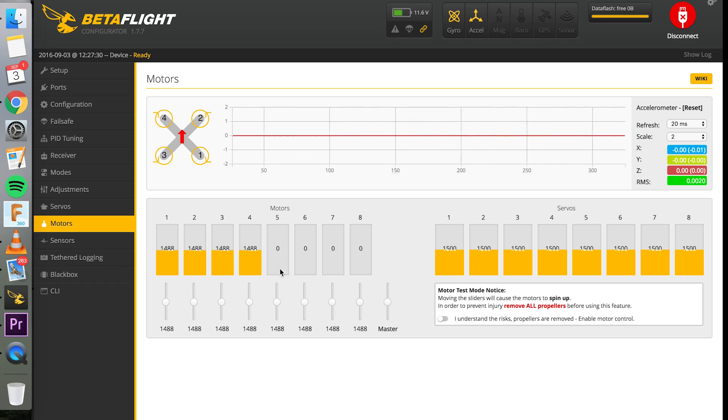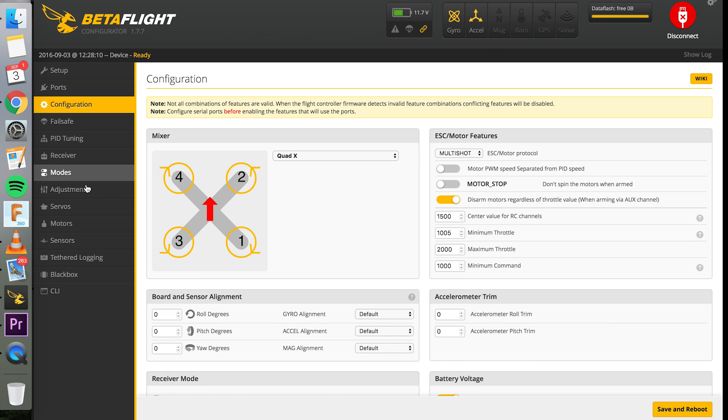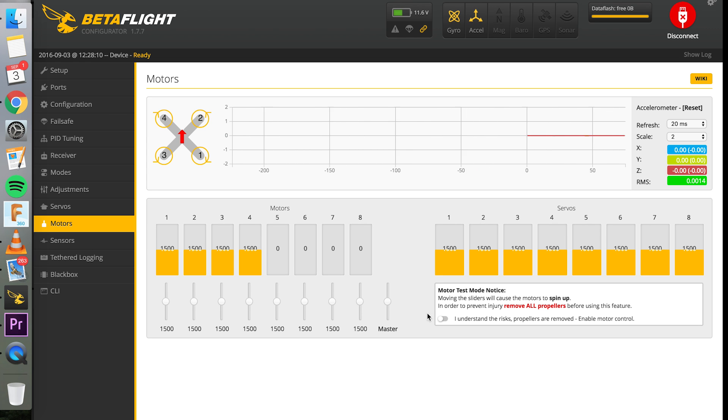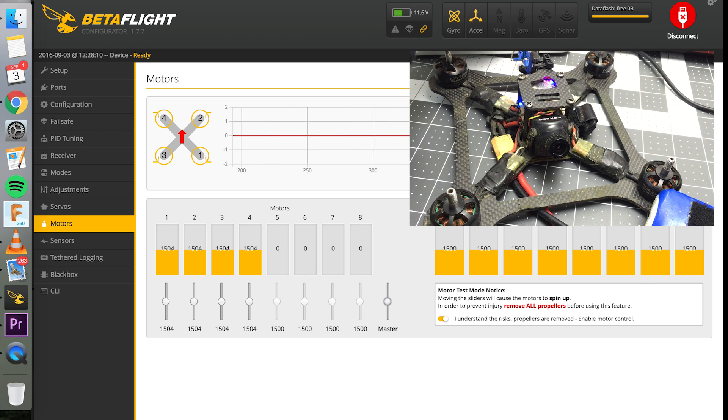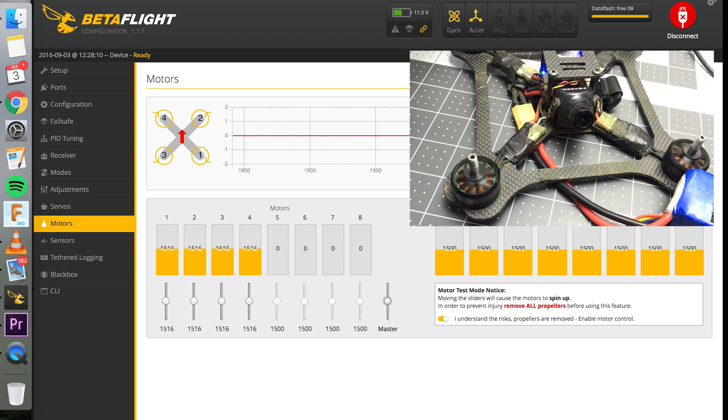You can see it's giving a center throttle position of 1488. I'm going to go to Configuration — 3D neutral — and since I set the middle position in BLHeli Suite to 1500, I'll set it to 1500, save, and reboot. Go to the Motors tab and now it's giving 1500. Click the master switch and arrow up — at 1517 my motors are spinning. You can get really good results with high-quality ESCs. I'm using the Aikon 30-amp ESCs with BLHeli S firmware, so you can get very slow motor speeds. Look how slow these motors are going — really slow for 2300 KV motors. And if you go below 1500, it's now spinning the other way.